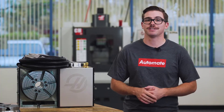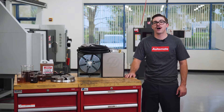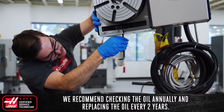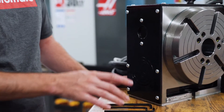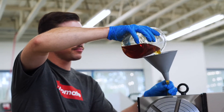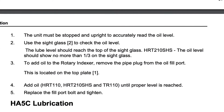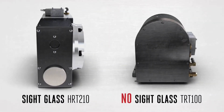I'll reference several different documents throughout this video and we'll put links to those in the description below. Just like the engine in your car, your Haas indexer or rotary table needs to be serviced periodically to make sure it's running at peak performance. We recommend checking the oil level on your unit annually and changing out the oil every two years. You can check the oil level by looking through the sight glass located on the side of your unit. Ensure the unit is stopped and upright in order to accurately read the oil level. When filled to the proper height the sight glass should be one-third to completely full depending on the model. Make sure to check the user manual to determine the proper fill height of your specific rotary. Note that some models do not have sight glasses, so it is even more important that you keep up with the routine maintenance of your rotary.